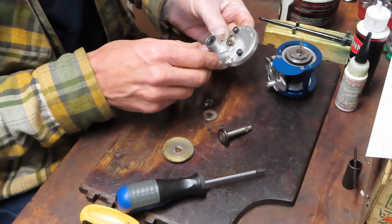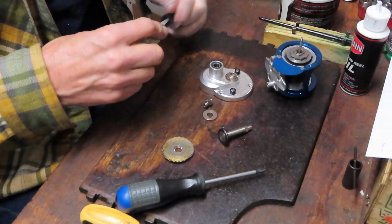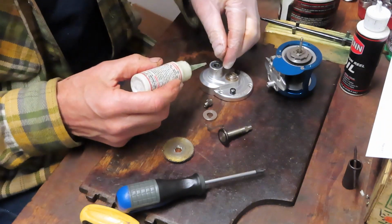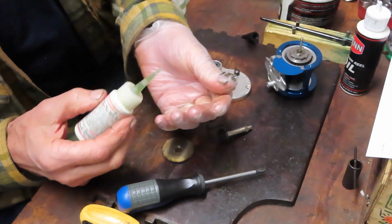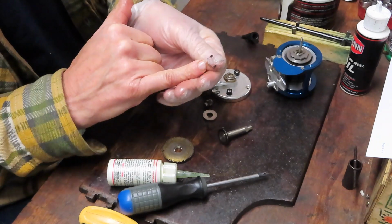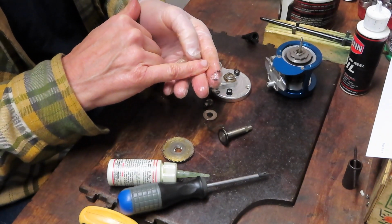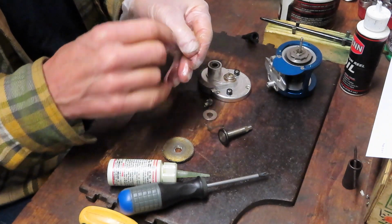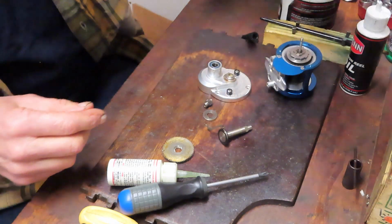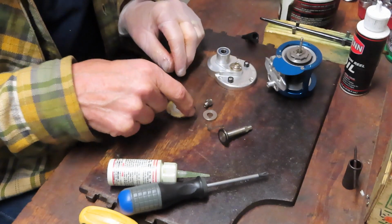So there's two bearings on this collar. I'm not sure if these are sealed bearings or not. It's kind of hard to tell, but it looks like they are. But they don't get hurt. Let's get some junk in there. I imagine this is why we have the issue with the sluggish performance. There's something caught in here. It's either very fine braid. Yeah, I would vote for very fine braid, but it could be hair. Not sure. But that's obviously one of the reasons why this thing kind of bogged down. The other is the dried grease and the like in here.